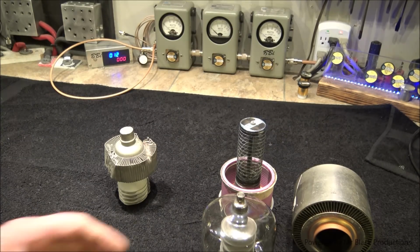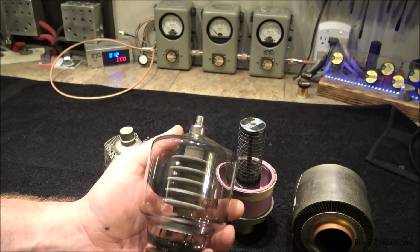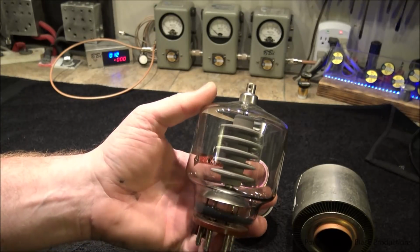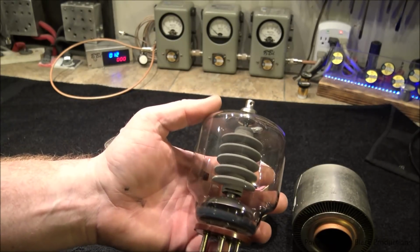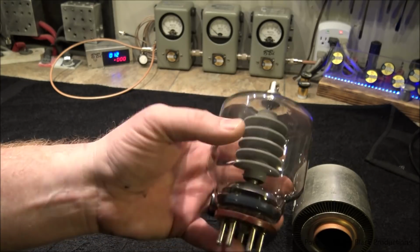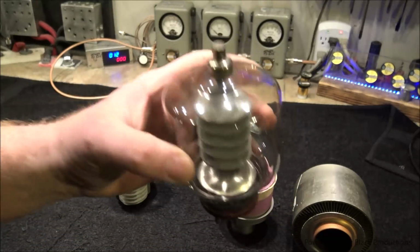So if you wanted more power, the tube had to be exponentially larger, much, much larger, to make sure the glass vacuum vessel could adequately radiate the heat and wouldn't become so soft that the outside ambient air pressure would make it collapse in on itself. These are usually made of Pyrex or a form of Pyrex glass. This tube is garbage.